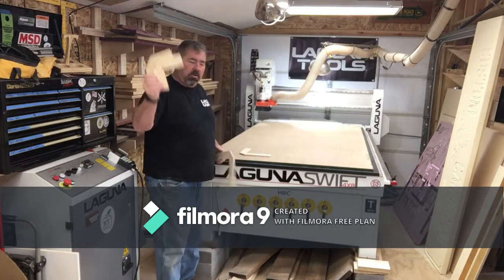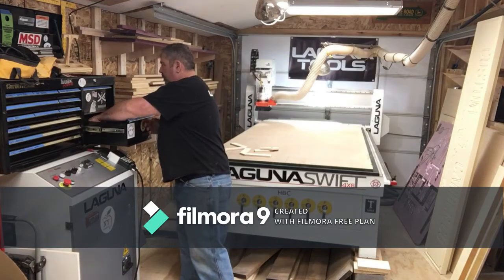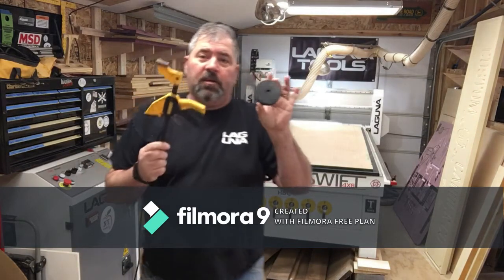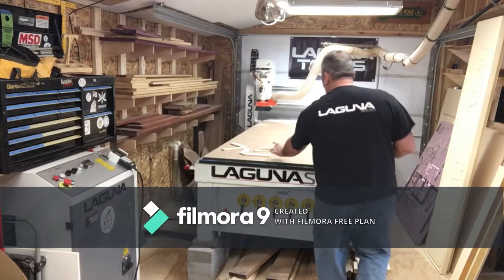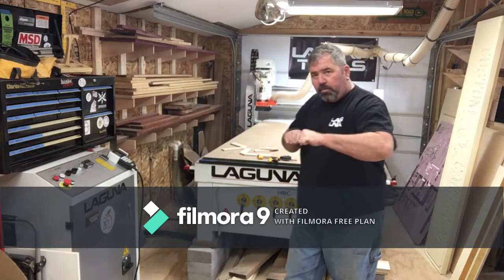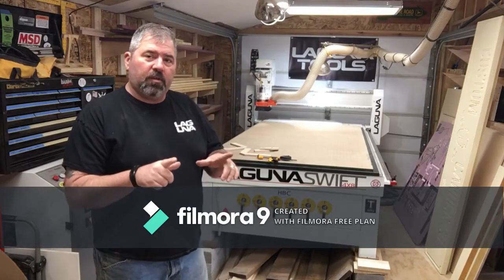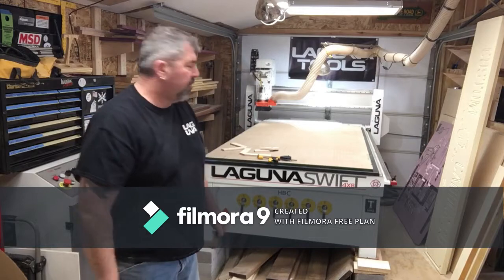And I've got small ones, and everybody makes fun of me, but my clamping system is hockey pucks and reverse quick clamps. So you screw these down, and you throw your clamp in there, and you can put pressure against something. You put a piece in at a right angle, which squares it to the table, you screw down a hockey puck, and you hold it with a clamp. I'll put some pictures in.